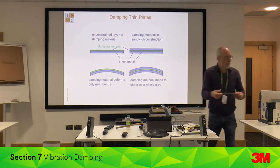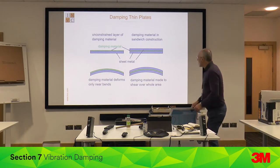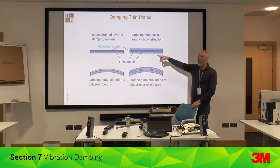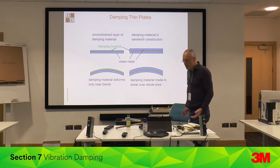This laminated material is an order of magnitude more efficient than bitumastic. Plus, bitumastic peels off, it's not bonded, and it wears off. Whereas this material is bonded to the steel itself. As an engineer, I'd much prefer this because it's permanent and it's rugged.